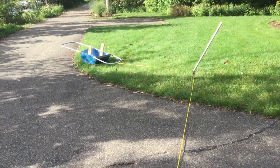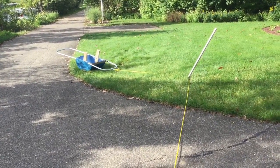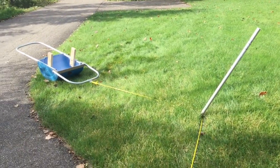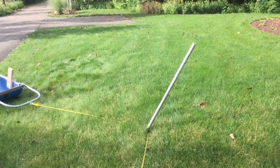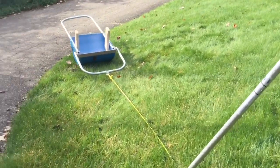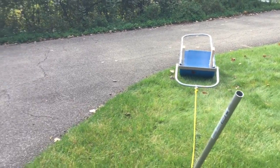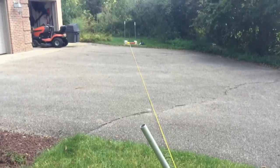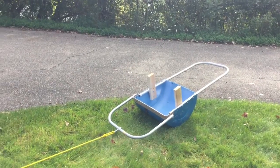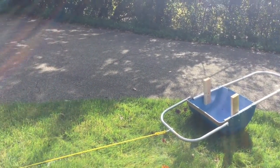This is how you do a right-angle turn — say you don't want to go just straight in and out, you want to go in at a 90-degree angle. I went out and drove this stake out into the lake about 10 feet further out from shore, drove it in on an angle, then put the rope around it and got the scoop out there. Now I can come in at a right angle — this here is where the winch is, and here is where the scoop is, all at a right angle, so you can move the scoop around to hit any angle you want.